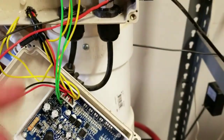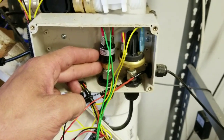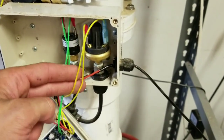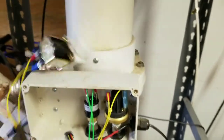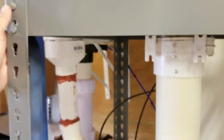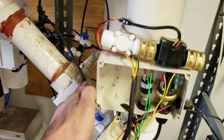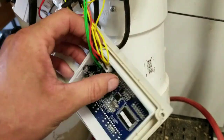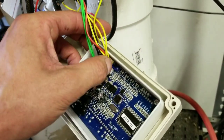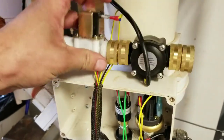For the run button, that is going to get wired to this one — the one that turns on at 40. This one turns on at like 10 or 13 or something like that. What it's going to do is open up the circuit that goes to the solenoid valve, and that'll stop the water silo on the side from filling while the dump valve is open. It won't start filling until the knife valve closes. There are two yellow wires right there — together on the same plug — those power the solenoid valve.